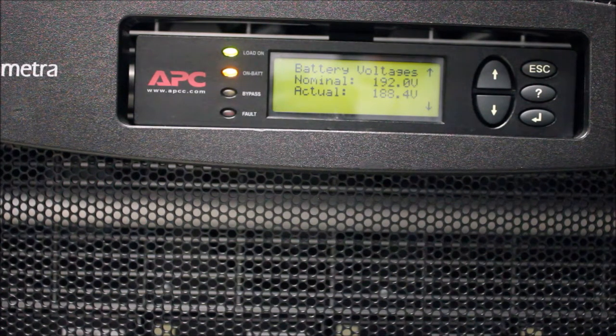As they get older and weaker, this value will go down. As you can see, our batteries are in the mid 180 Volt range, indicating that they are getting weak. Batteries approaching the low 170 Volt range will need to be replaced as soon as possible to avoid little to no capacity while on battery.